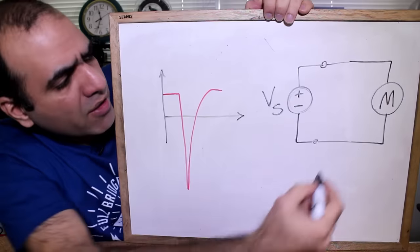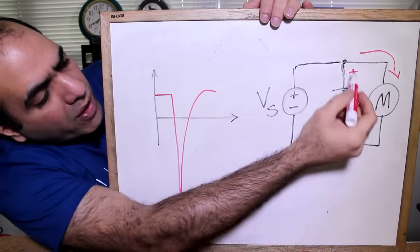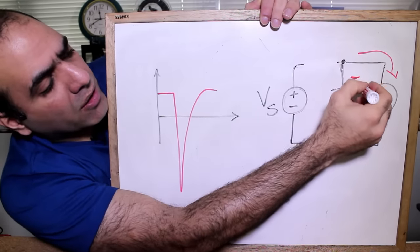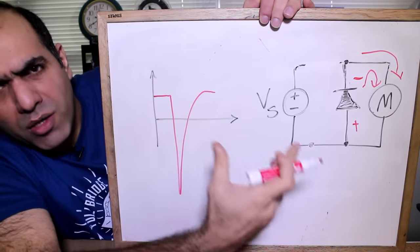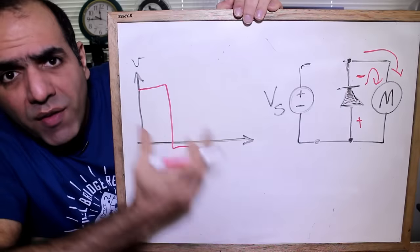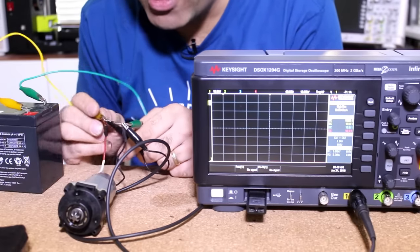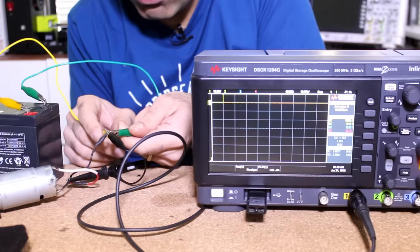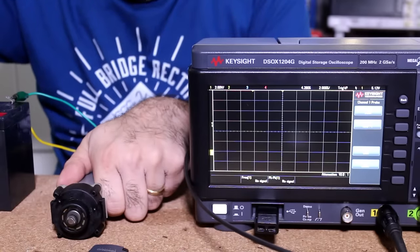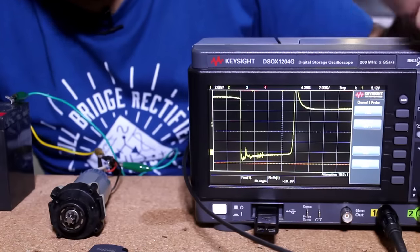There are problems driving motors — let's try to solve them. First, the high voltage spike at shutdown: a good solution is to add a reverse diode across the motor, called a flyback or freewheeling diode. When we run the motor the diode is off, but when we disconnect the motor and the voltage flips, the diode turns on and the current loops through it for the short time constant of the inductor. So the reverse voltage across the motor will be limited to around minus one volt. My diode blew up because it was in reverse — so in this method we can only run the motor in one direction. Trying again: the voltage only goes negative a little bit, there are no arcs, and the voltage rises back up due to back EMF.